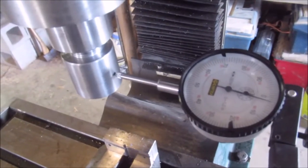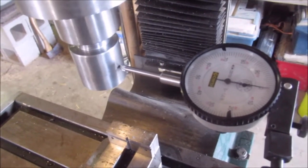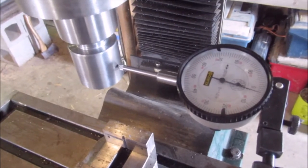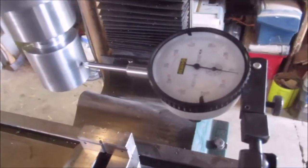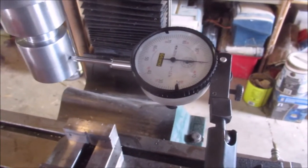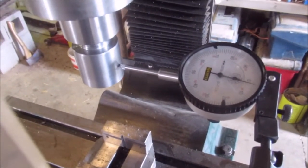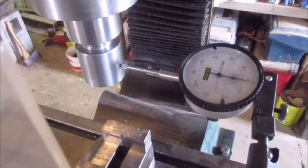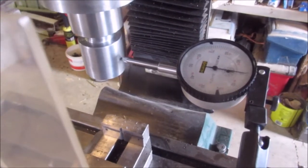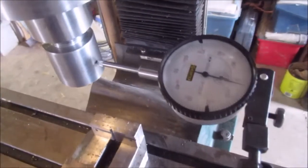There are techniques to get things bang on, and when they don't get bang on and you use those techniques, that means something's either a burr or... But that should be dead nuts since I machined this through centers. Maybe it's because of the threads on the other side. I had put a chamfer on it to start my thread, and I made that chamfer deep enough, so I thought it would be okay to reuse it on a center. Maybe it wasn't. Maybe that's why it's off by 2/10. I don't know.